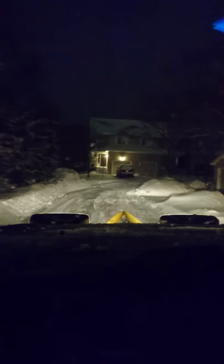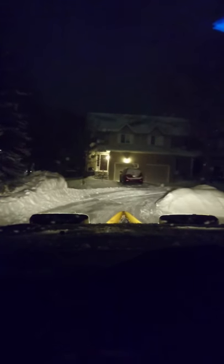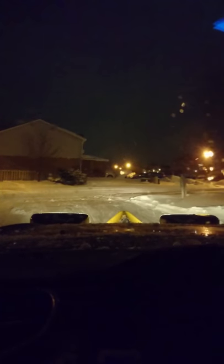Alright. Time for the salt to go down. It is minus 14 Celsius. Okay, I didn't bury the end of their driveway. Salt doesn't actually work all that well in these temps, so I am running a pre-wet magnesium calcium mix in a tank, sprayed out onto my salt as I salt, to get it a little prettier.